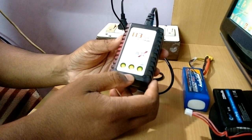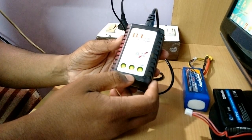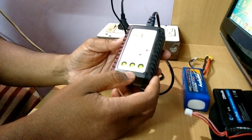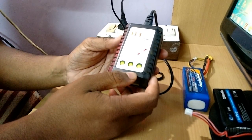Please do not try to charge a battery with a faulty charger — it may be dangerous, it may blow the LiPo or can hamper the cells of the battery pack. So please do not connect a LiPo to any charger if you know that the charger is faulty. But if all LEDs are green like in my case, then you can connect a LiPo to the charging port.